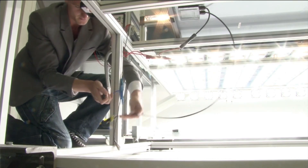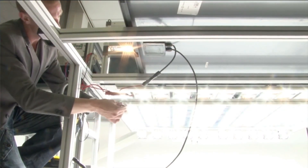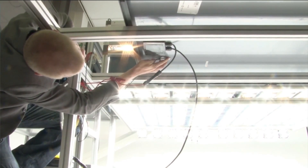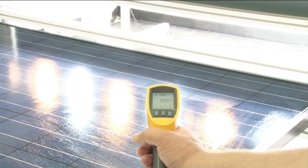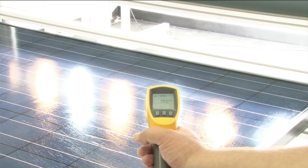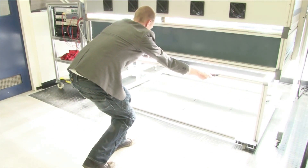The crystalline silicon solar panel needs to be connected to the voltage supply and the ampere meter. In addition, a thermocouple is connected to the panel to monitor the temperature during the JV measurements. Without additional temperature control the solar panel will heat up in time. Here we demonstrate that the panel is at the required 25 degrees Celsius using a Fluke infrared thermometer before the panel is moved under the solar simulator.